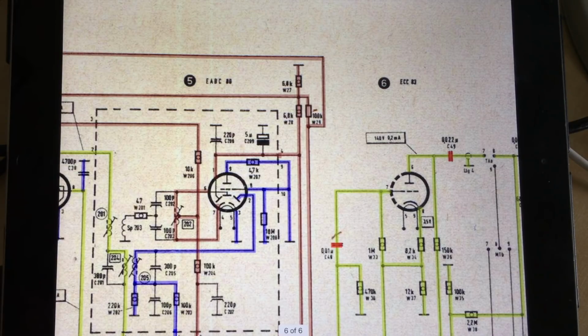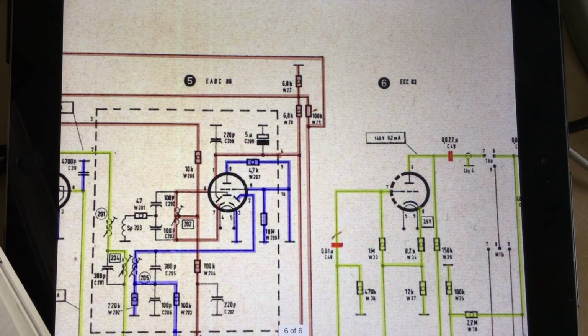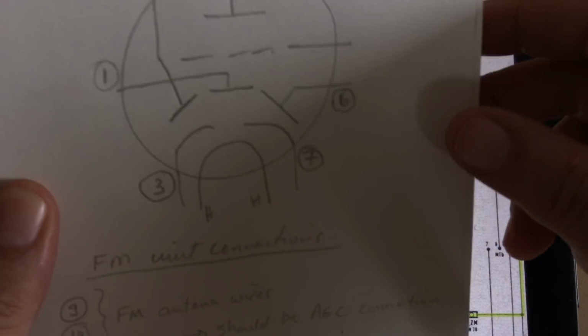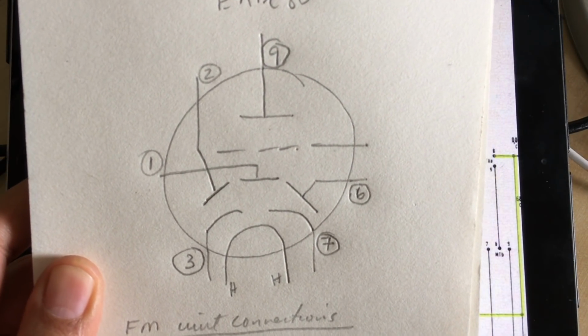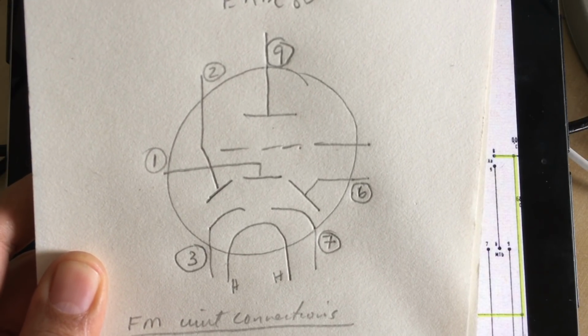Another thing I've realized while I'm here is that, as one of my subscribers mentioned, you can't figure out what kind of circuit this FM uses, whether it's a slope detector, or what circuit it uses. It is a little confusing, and the confusion is actually increased by the fact that the tube is not wired as per the numbers on here. I've done a quick sketch which shows the actual wiring, and the reason this is different is because these diodes in here, two of them share the same cathode.